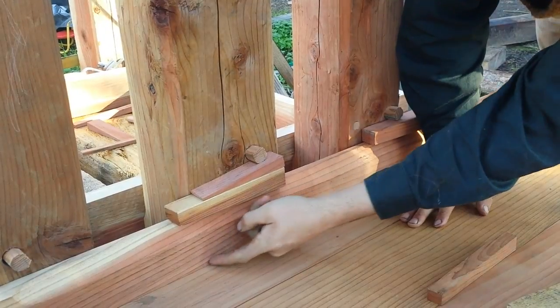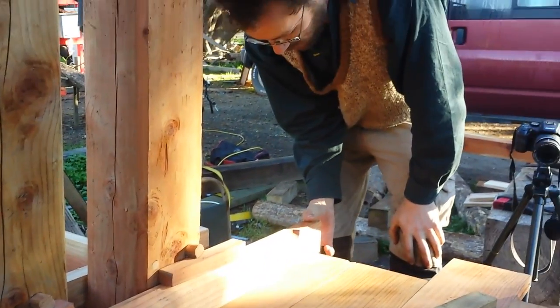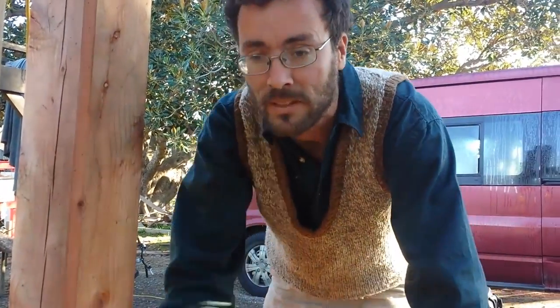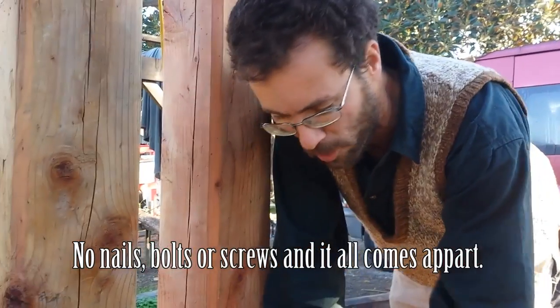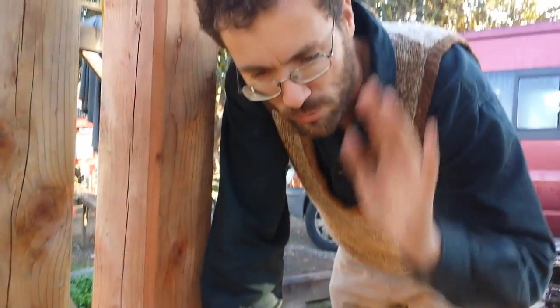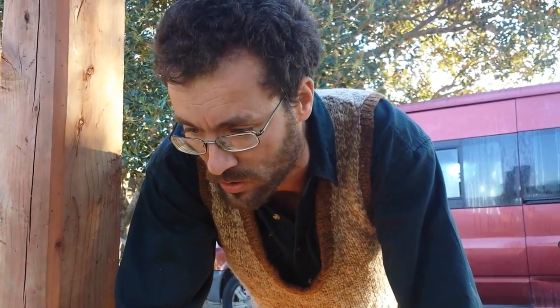That's sealed that joint up there. Before we get pressing I'm going to make another clamp to sit there and hold that in so we're not having juice running out on this side. But that's basically how it's going to be done — just a series of blocks and wedges to hold it all together. Even if there are some small gaps, once it's all ready to go and we get it tight, as soon as the wood starts to get a little bit wet it'll start to swell and those gaps should all seal.